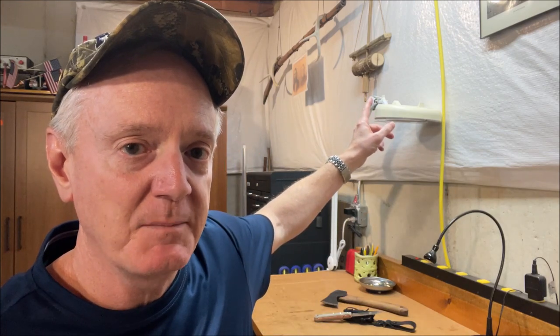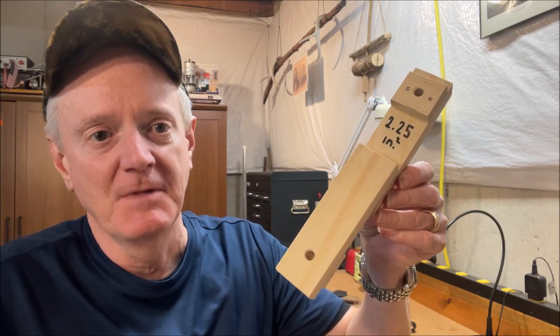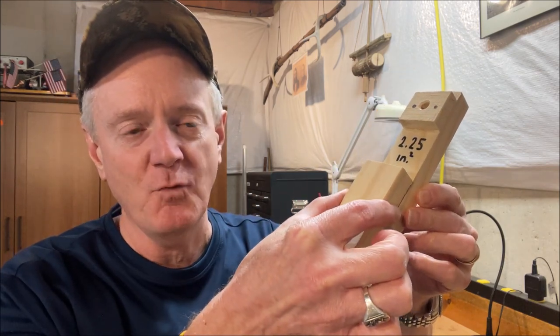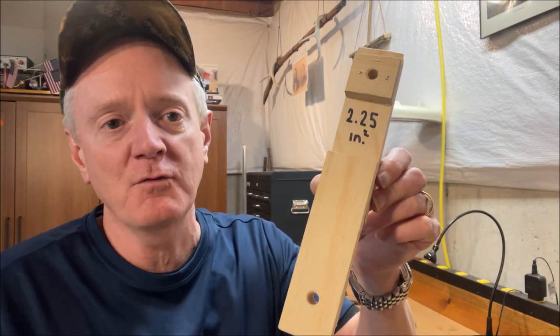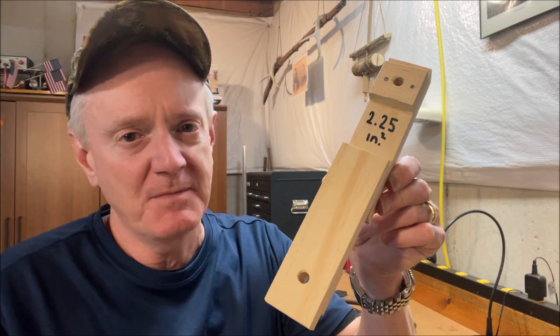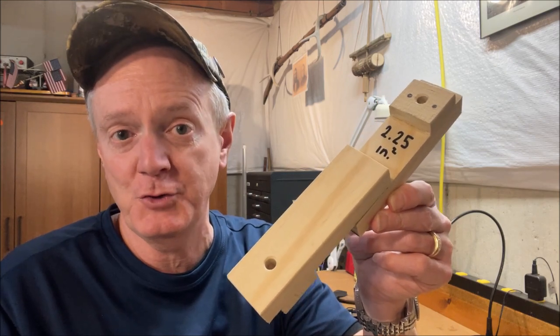This past summer I used some pitch glue to make that pump drill hanging on the wall — I'll put a link to that video in the description. I also made this lap joint test fixture for some informal strength testing. I made it out of scrap 1x2, which is actually an inch and a half wide, and I marked off a square overlap area of an inch and a half by an inch and a half, giving me an overlap of about two and a quarter square inches. I looked at the joint carefully though and I'm not convinced I got it fully evenly coated, so I'd estimate I've got about two square inches of coated overlap area.